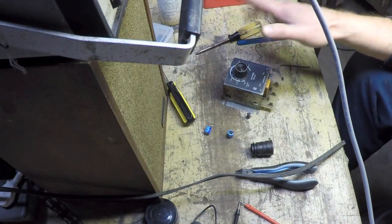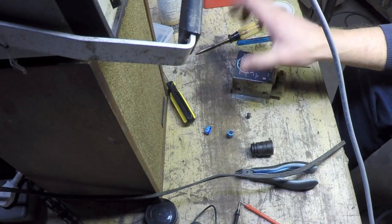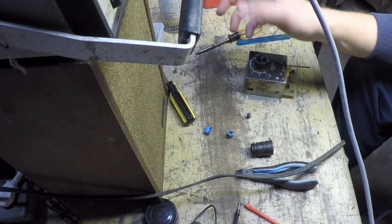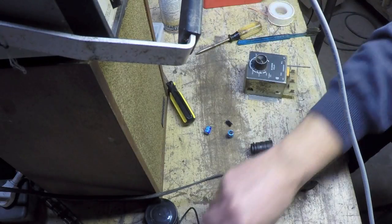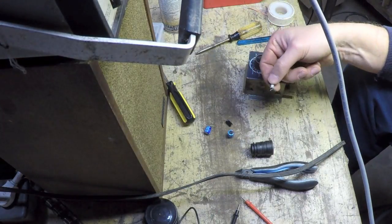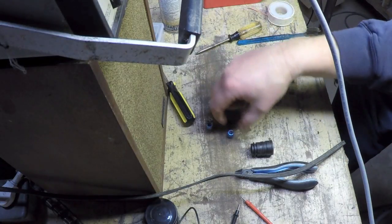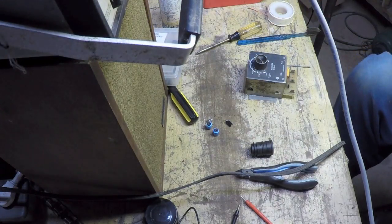So anyways, there's only three electrolytic capacitors in here. Unfortunately, I have a limited stock of new capacitors, and that assortment right there does not have any 3.3, I think it was. What was in here was a 3.3 microfarad at 50 volt, that little sucker, and two 100 microfarad at 35 volt. I didn't have anything in this assortment, so I decided to scavenge them from other equipment.